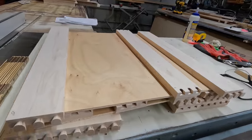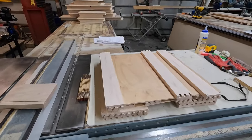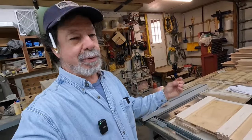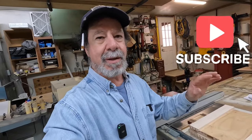By doing it this way you can dial this right into your thickness, because unfortunately all these pieces are not the same. On this job I'm combining doing mine — I've got like 17 dovetail drawers to do all together, 17 or 19, I think it's 19. I didn't take it all out of one sheet, and sheets vary in different thicknesses — this way I can dial them all in.